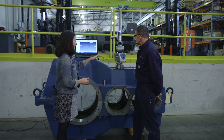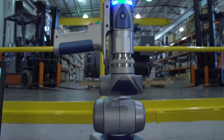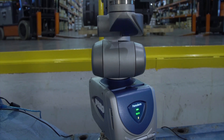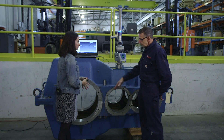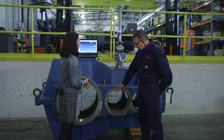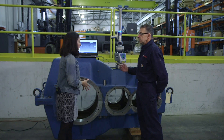This is really neat. That's correct — it's a tool, a coordinate measuring machine. It's both portable and deployable, and stationary. Here it's stationary with the magnetic base attached to the workpiece, and from here it's basically verifying geometry such as diameters, flat planes, the relationships between the two, the centers between axes, shafts — those kinds of things.